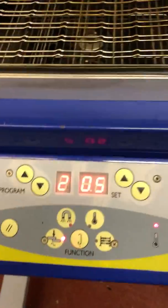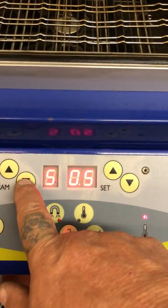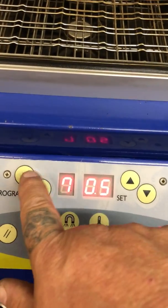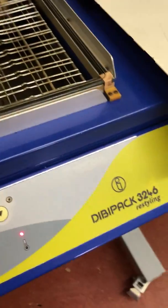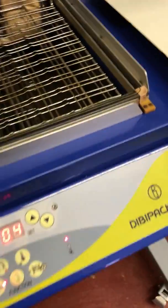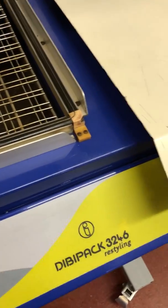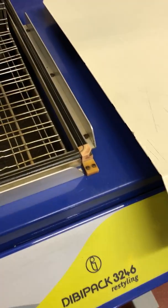We've got, it's in good condition, this machine. As I say, it's had a new control panel. These functions, it wouldn't let you scroll through the programs, so it means somebody's been in there with a big fat digit and prodded it too hard and broken the momentary switch on the circuit board, so we've replaced that. Inside, the power board's been replaced on this. Again, when we took it apart, there were signs of some sort of dampness, so I would think someone's probably stood a drink on it and spilled it.